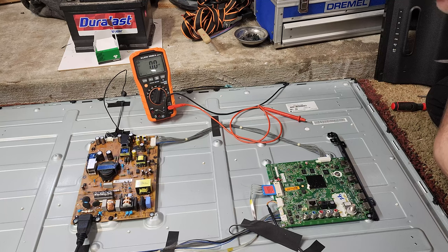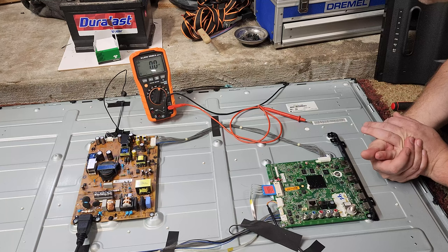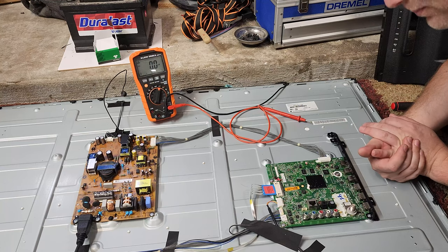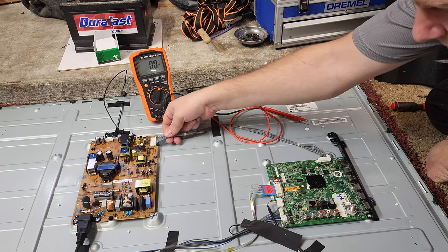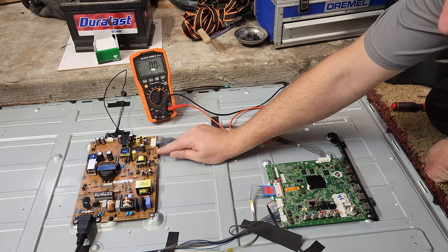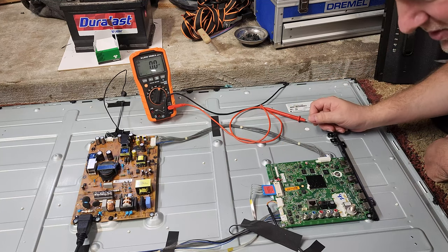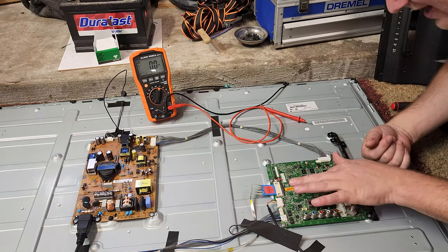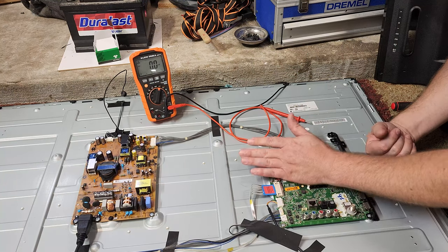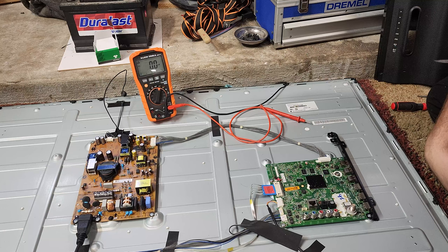All my voltages are stable — this sounds like a pretty sound investment for a repair. Thanks for watching, hope you like these teardown and nitty-gritty how-things-work type of videos. It's important to know there are different power phases that come out of a TV power supply, and there's almost always a legend printed somewhere on the PCB. On other boards, there's usually a silkscreen describing what each wire does. The dead giveaway here is no image and a CPU that's extremely hot — that's probably it. Thanks very much for watching.